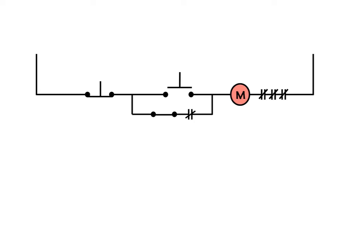The only way to disengage the circuit is to push down on the stop button and open the circuit up. When we push down on the stop button, the M-coil will disengage because it has no direct path to energize it, and these contacts will open up as well, returning us to a de-energized state. So that is how the selector switch works for a jog circuit — in the closed position we have run, and when it is open, the start push button just becomes a jog button.